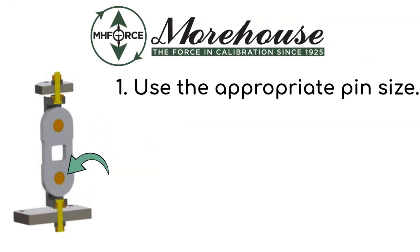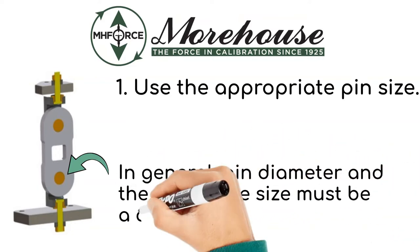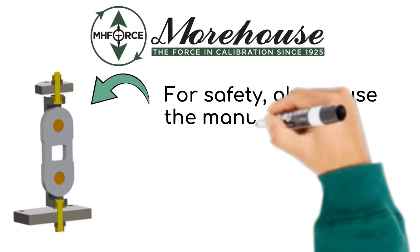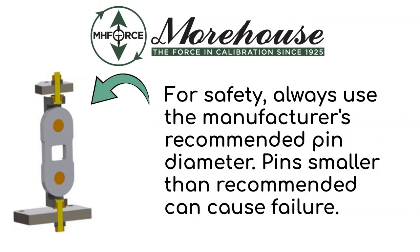In general, pin diameter and the clevis hole size must be a close fit. And for safety, always use the manufacturer's recommended pin diameter. Pins smaller than recommended can cause failure.